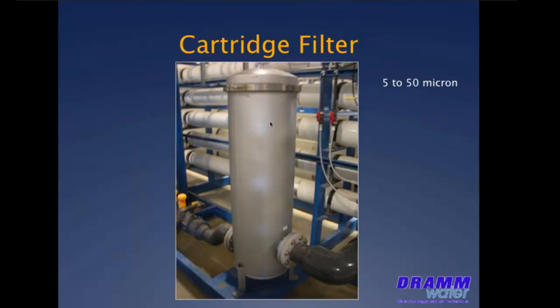Cartridge filters have been around for years. They offer good fine filtration, generally down to about 5 microns, with variable filtration levels. It's easy to pop out a cartridge and put a new one in. The cons are there's no good backwashing mode, cartridge changes require a complete shutdown, cartridges can clog very quickly in high turbidity, and they are very subject to biofouling from chemicals or almost any source. They're good for tertiary filtration from 20 down to perhaps 5 microns, and for pre-membrane or pre-treatment filtration.